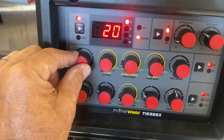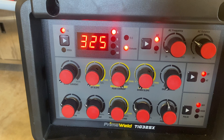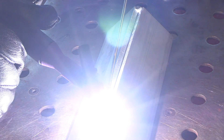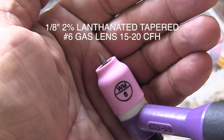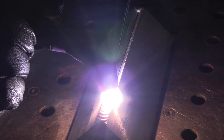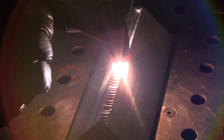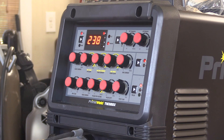On the box cutter blades I set the start amperage to 5; I'm going to set it to 20 because I'll be using a one-eighth electrode. I set the main amperage wide open at 325, but I'll put a camera on the machine and we'll see what it takes to weld this piece - quarter inch on an outside corner. I'm using a one-eighth 2% lanthanated electrode with a tapered tip, a number 6 gas lens, and 15 to 20 CFH argon. I'll just be quiet for a minute and let you listen to this arc. This is 50 Hz - I like using lower frequencies on a thick outside corner joint; it kind of wraps the corners with a nice wide arc.